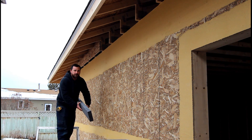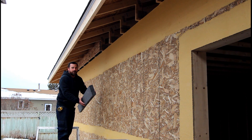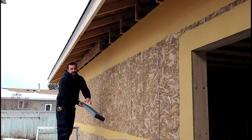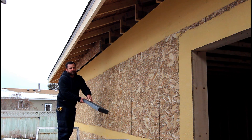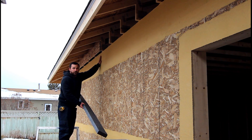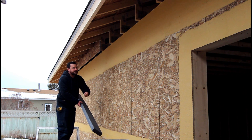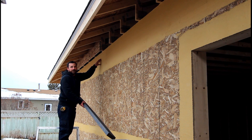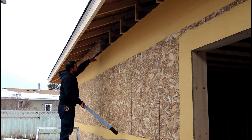The next step is we're going to mix up a product called BTS — it's a ready-to-mix bag polymer cement that can be used as an adhesive and a base coat in the acrylic stucco world. We'll mix up a batch, then trowel it onto this foam using a notch trowel and bond it to the Gold Coat. This is EPS foam — it looks gray because this type of EPS was infused with graphite, so don't be thrown off by that. You apply it in vertical lines so that if moisture does get through, there are no mechanical fasteners for it to penetrate into your building and rot it out.